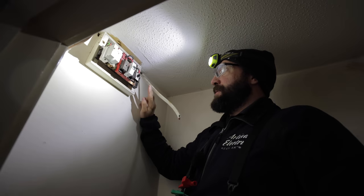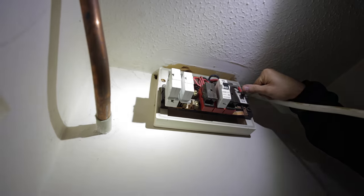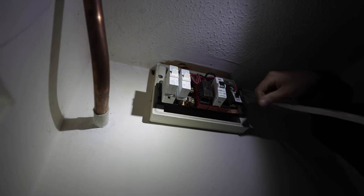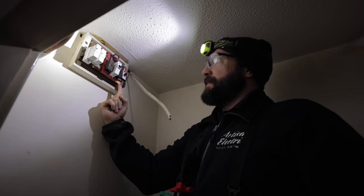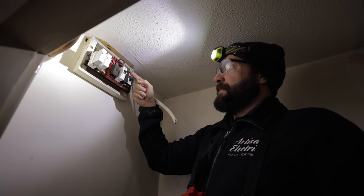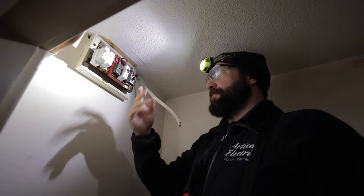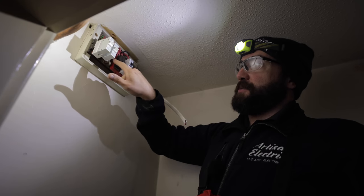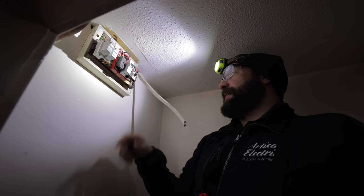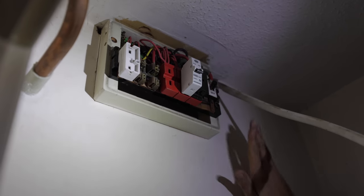Jordan was asking about the worst electric shocks we've had. I always bang on about these fuse boards because I've had two electric shocks off of them and a short circuit off of them. When you turn it off you can slip and touch - same goes when you turn it on, you can slip and touch the bus bar, and I've done it both ways. I've also inadvertently put a link between here and the earth bar and then turned this on by accident, which then blew the test lead and shorted out quite badly - just a smoldering mess. They're really dangerous to work on.